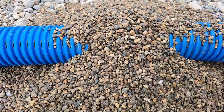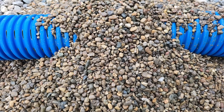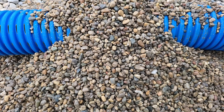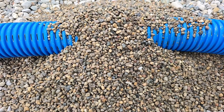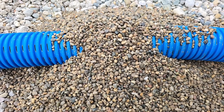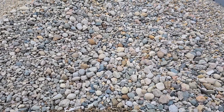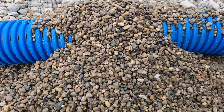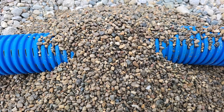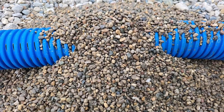Here's the one catch: if you're building a yard drain like this, it's going to stay damp — it never dries out. Tree roots are going to absolutely love this; they're so happy when they find a vein of pea stone. If the root doesn't dry out and get air-pruned, you end up with a thriving, happy tree. That's why we don't do this in yard drains. I'm making this video because people that are misleading others about fabric are telling them to buy number 57 stone and larger stones that you absolutely cannot use when you don't use a soil separator. You need a good stone filter zone — it has to be small. This will last a while, until tree roots and shrub roots start getting inside the pea stone. I don't recommend this for yard drains.